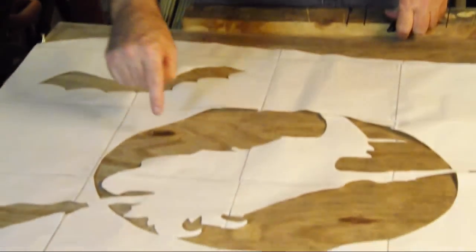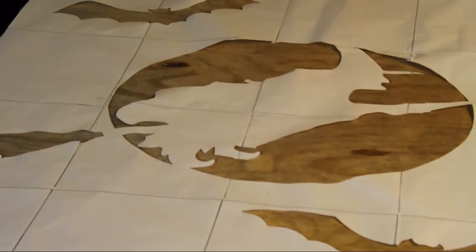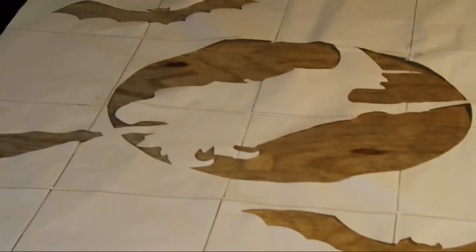And simple enough, if you look in the description below, you'll see a hot link, and it'll take you to our website where these plans are available in full size. And they're going to be printed out in 8.5 by 11 inch sheets, and they're numbered. Tape them together, cut out with a pair of scissors the gray areas. Those are going to be our cutouts. Trace it out with a black magic marker. Drill holes in every area that you see a cutout, and using your jigsaw, cut them out.